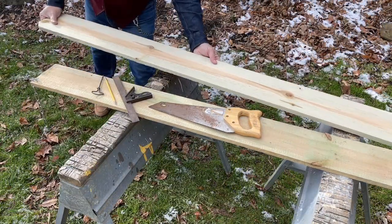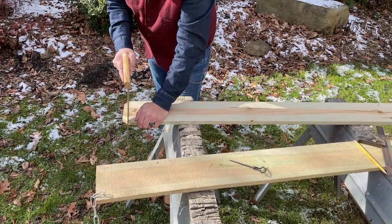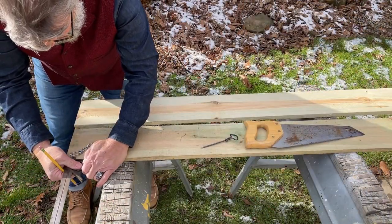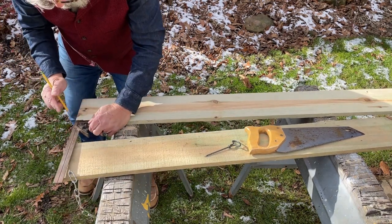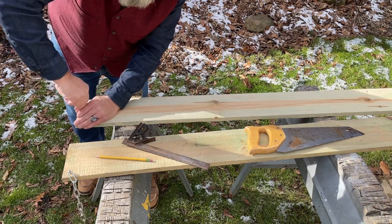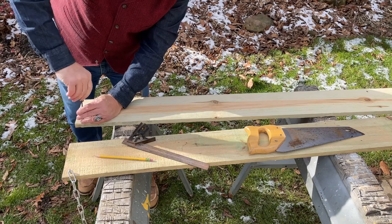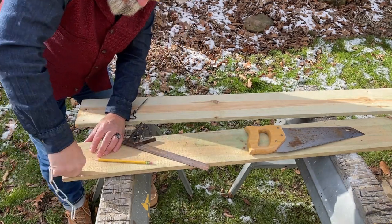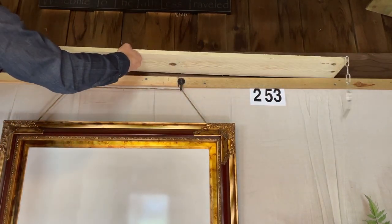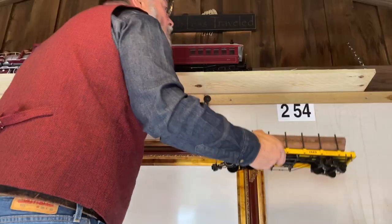I can show you better with a small piece of scrap lumber. Here you can see this piece of lumber has a cup in it, and now it also has a twist. This is the problem with my shelf, and the winding sticks help me identify this problem. So I simply grab another board that's much straighter, cut it to length, transfer the hardware, install it — and problem solved.